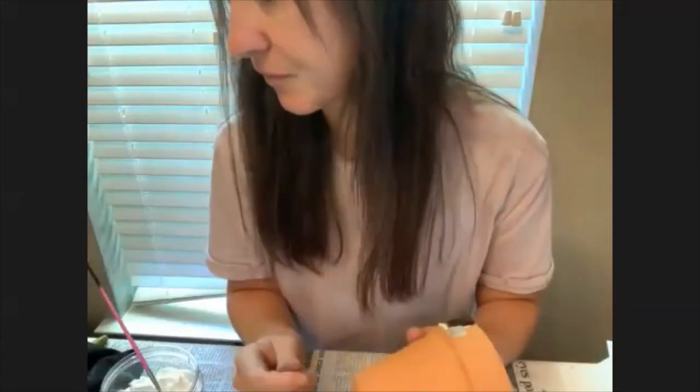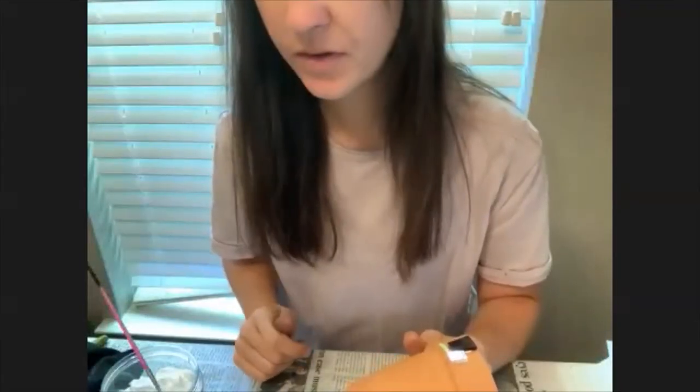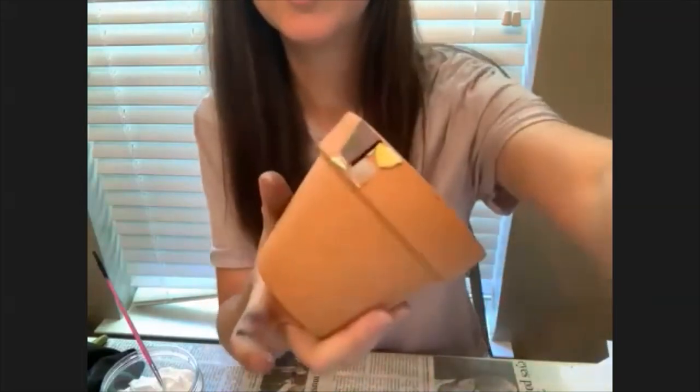This is thick glue. Yeah, it's actually, what do they call it? Silicone? Is it really sticky? Yes. It's actually just latex caulking. You can buy the specialty glass glue, but it is essentially what you buy from the hardware store. So I just get a caulk gun and some caulk, and I just squirt it out for you guys, because otherwise it's very expensive. You can buy this stuff at Home Depot in the paint section. You just need to get the clear all-purpose silicone caulk. So it'll dry clear, right? Yeah, exactly. It's going to go on white, but it's going to dry clear.